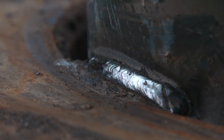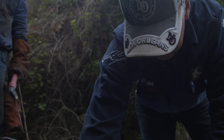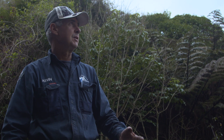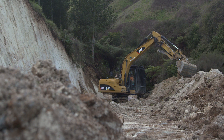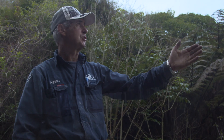Mark's just welded a couple of plates either side here and there's got to be concrete all through here — it's going to come right around and create a bowl to catch all the splash from the water. It'll eject out of the waste valve. The next thing to do — which is what Corey's doing up here in the digger — is to create a one-in-four incline going up the hill for our first piece of drive pipe.